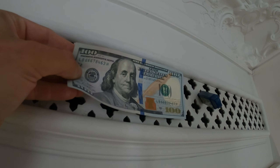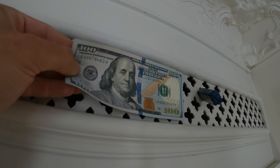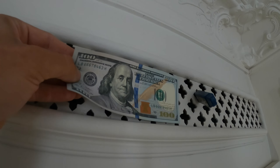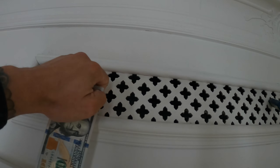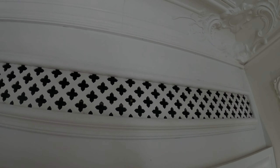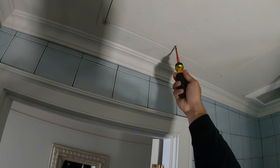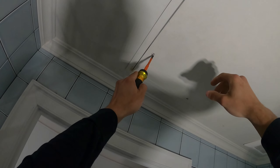We're in the room — here's where the air comes out, here's a supply grill. Look at the temperature — it felt nice coming in here, it's 54.9 degrees and dropping. So the issue is that it was too warm in here, but that's clearly not the case. It actually feels good in here considering it's like 90 degrees out.